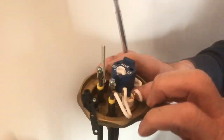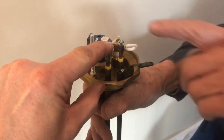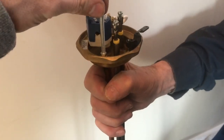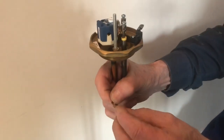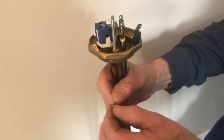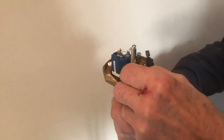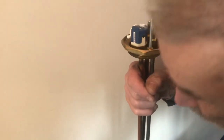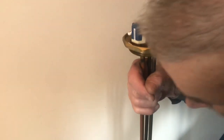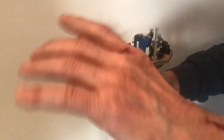The supply connects after it's fitted into the tank. That's the neutral connection, and this one here is the earth — it's important to get a good connection. The brass washer should go on upside down so that when tightening, the cupped part of the washer isn't in the way of the nut. Then we put the locking washer on, then the nut — only put the nut halfway down so it's all ready to make the connection when we get it into the tank.